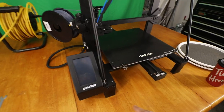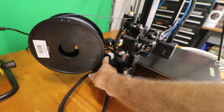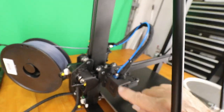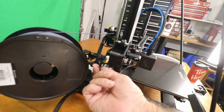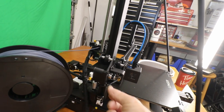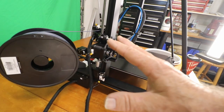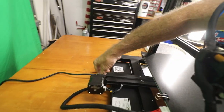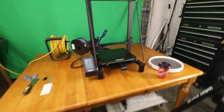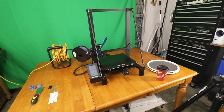I've put two bolts to hold the display on and two small screws for the bracket in the back. I've already put my filament on and fed it into the extruder, which feeds through a Bowden tube down to the nozzle. The wiring is all well marked - X motor, extruder motor marked E, X limit switch, Z limit switch - it's a no-brainer. Don't forget to plug in the power cable in the back. At this point you should have the Longer LK5 Pro all put together and ready to go.